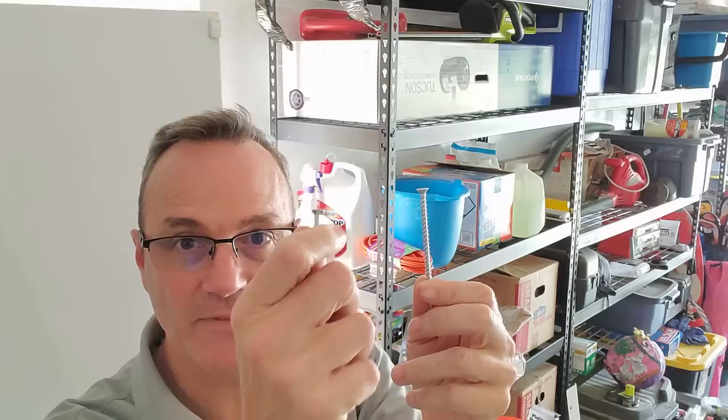As we covered in our video on reinforcing a door, one of the least expensive things you can do is put in three-inch screws in all of the screw holes. Most doors come with little half-inch to one-inch screws — throw those away and get three-inch screws in there. These come with this kit so you don't need to buy them separately. Note that this particular kit came with a square drive, not a Phillips head, so you'll need a special bit. If you don't have that, just get a package of three-and-a-half-inch screws and you'll be good to go.